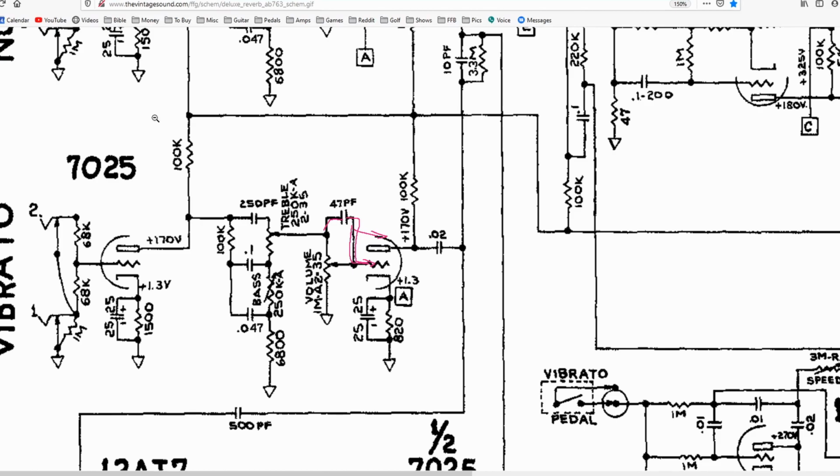Now, the last thing that I want to mention from a practical perspective is how this impacts pedals, because that's the technical explanation. From a practical perspective, like I indicated before, having a bright cap or a bright switch really mostly impacts the function of the amp when your volume control is set low. Under, or farther under, is going to be most impactful. And if you're going to be running the amp volume low, there's a good chance you're probably going to be pairing it with some overdrives to achieve your driven tones.